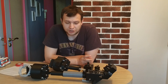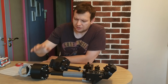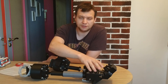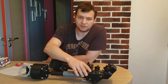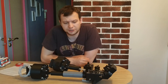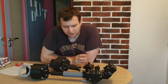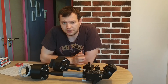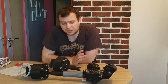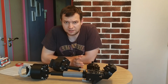So now this approach has changed, and every single device now creates its own joystick. So like in the collective, the base will be the lever body will be a separate joystick, the head will be a separate joystick, and each head will be a separate joystick with a different ID. So this may work good in the simulator when assigning control profiles to these heads and the other hardware. So the stick will be a separate joystick, the grip will be a separate joystick, this stuff will be a separate joystick. Everything is a separate joystick with the correct amount of axes and buttons and whatever it needs.